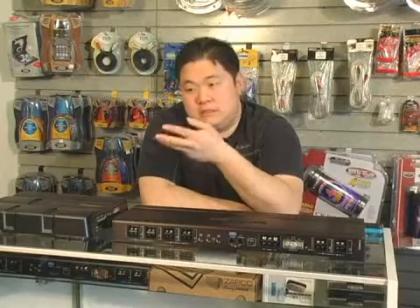Say if you took two four-ohm drivers — two speakers — and you put four and four together, that divides into two. You put two into a four-ohm amp output on a bridge load and it's going to go to two. Some amplifiers are only two-ohm stable stereo and they might be four-ohm stable mono. And then there's eight-ohm amplifiers that are four-ohm mono stable, stereo stable.